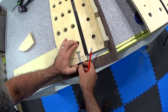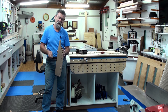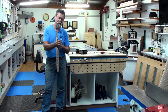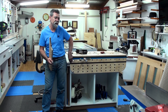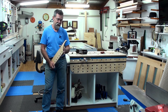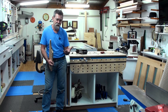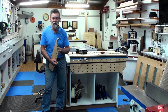I worked out the length of my cam clamp t-bolt, and here was the question: how do I get a tenon and a bolt side by side? What I did was use the domino with the 5mm cutter to create the recess for the top T-section of the t-bolt — recessing it into the back without coming all the way through. Then I cut it out with a jigsaw using a few 3 or 4 millimeter holes joined together, and created an 8 millimeter slot to allow the 5/16 inch part of the bolt — which is the same as 8 millimeters — to pass through.